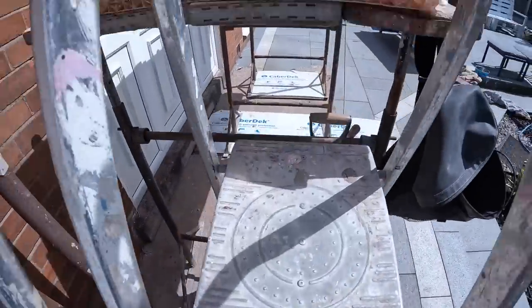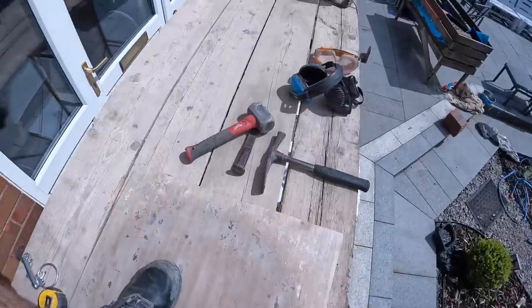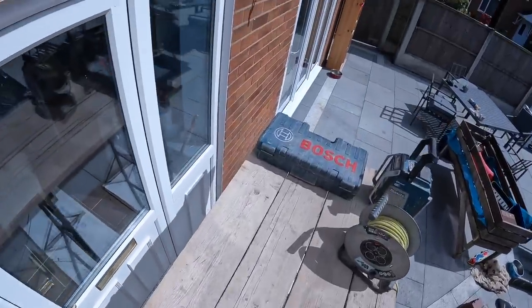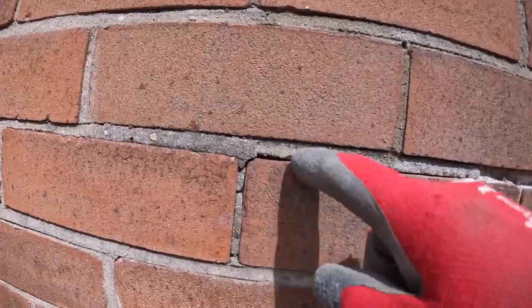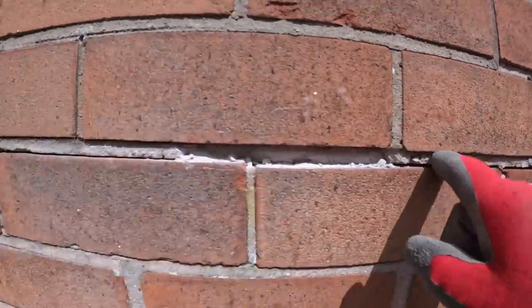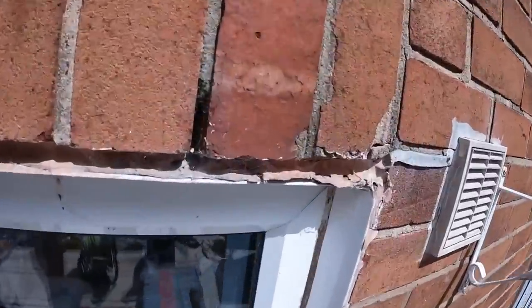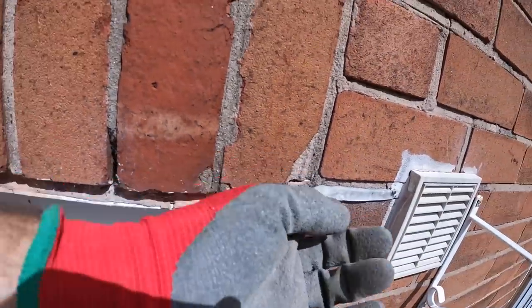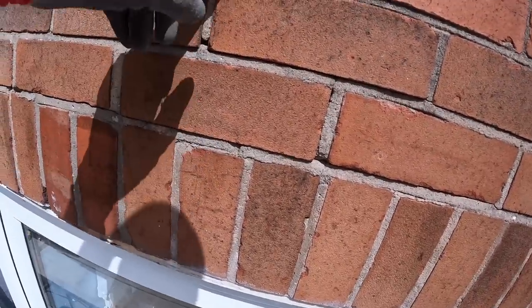Right, that's just cost us half a day running around picking stuff up from Berries and Fairwoods and Hodgson's and paying for t-shirts and stuff. So we're back. As you can see, solid crack, because judging by where that brickwork goes in line with that brick, there's no lintel under this. It's just one of these funny lead trays. So our job now is take the three-quarter soldiers out, take these two courses out, investigate what's behind it, put it back properly.